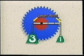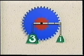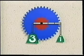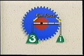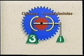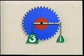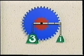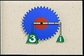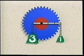Think of each tooth on a gear as representing the end of a lever arm that extends from the center of the gear to the tooth. With two gears fastened together on a single shaft, the lever arm of each gear is its radius. In the case of gears, the forces at the ends of these lever arms are called rim forces. Just as with the balance bar example, the clockwise and counterclockwise torques on the center axle shaft are equal, and the ratio of the rim forces is exactly equal to the gear ratio.